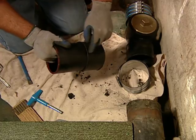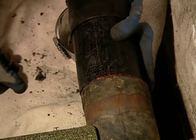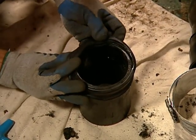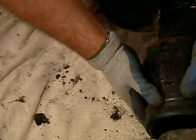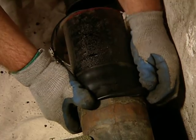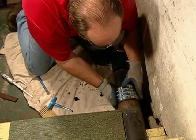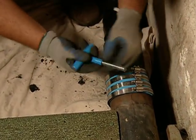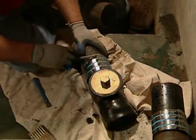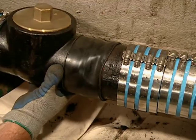Snug up the neoprene gasket on the new work. Now, you'll notice that the new pipe is slightly smaller than the old works. There's a little trick to getting this gasket on the old pipe — fold it back on itself, all the way. Then get it next to it and fold it. And now we'll snug it up with this no-hub coupling. I use a special wrench called a torque wrench, and that's designed to snug these bands up without over-tightening.